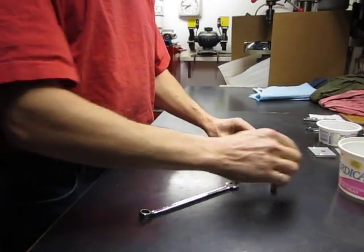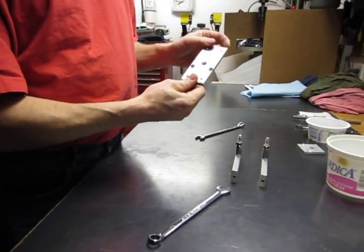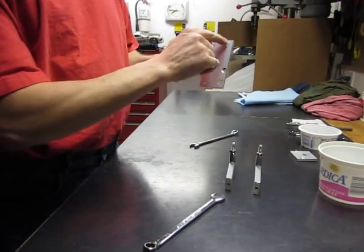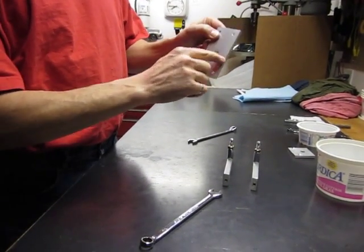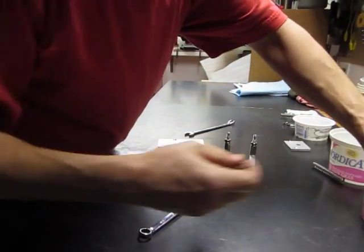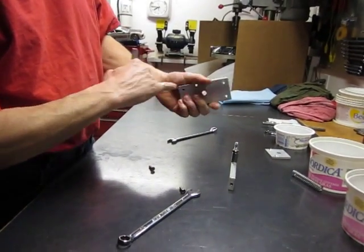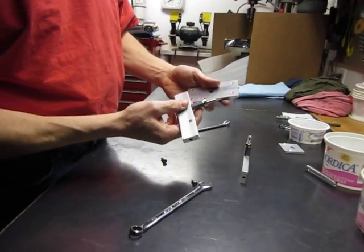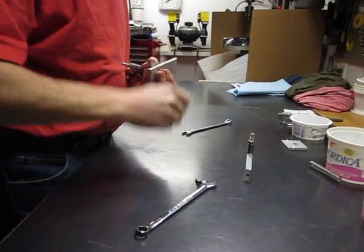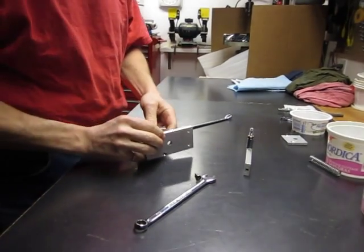These are the mounts for the bottom spring. The next thing I'm going to do is put on the front mounting plate. The front mounting plate has a hole for the main shaft, four holes to actually mount it to the box, and these countersunk holes are what's going to hold it on to the side arms. I have marked the sides — a single dot here, two dots there. That tells me that the piece with the two dots goes there, because the way these are fit together they're kind of machined as pairs.